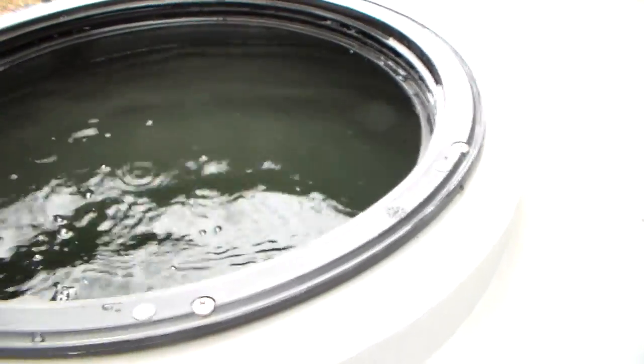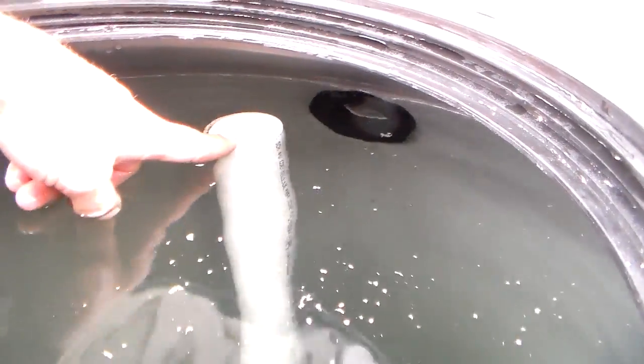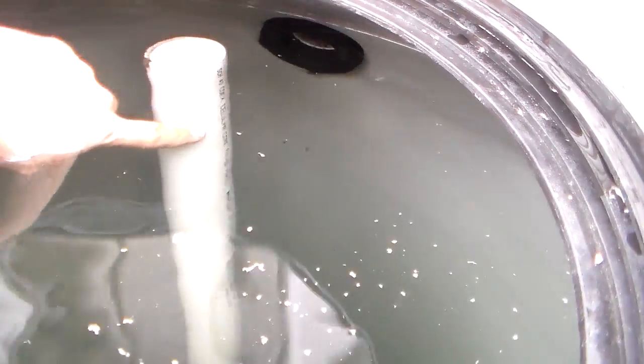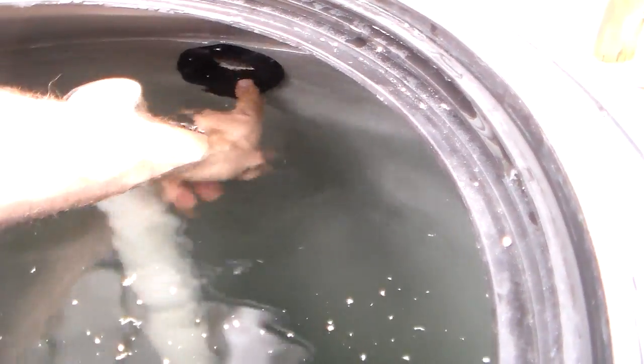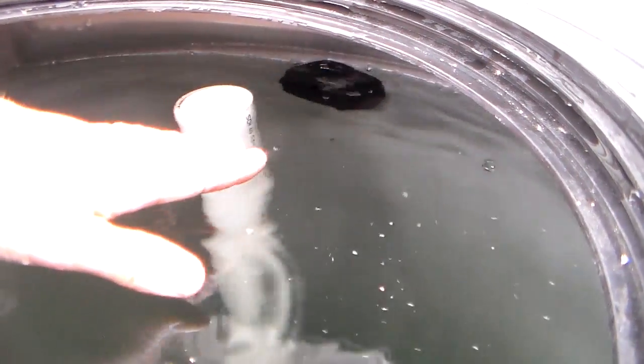I'm going to remove the strainer. Inside you have some PVC because I've done some major changes to this system. I have an overflow in here — the overflow is right there as you can see. I need to cut this overflow down a few inches; I want to get it lower than the inlet, so I'll cut off about two and a half inches to lower it. When water is coming in, it's constantly going out when it's raining and the tank is full, which is what you want so it's always refreshing the water. When it fills up, it overflows into this pipe, which comes out the other bulkhead fitting on the bottom and takes it away from the tank.